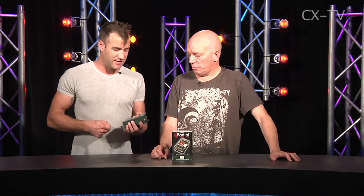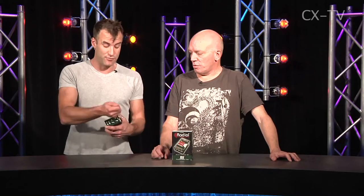A couple of things distinguish this. First up, internally, Jensen Transformer. It's passive, so there's no battery and there's no kabang when you unplug the mic lead. Any DI is going to go kabang when you unplug the input side of it. But if it's active and if it's phantomed, which this is not, this is not going to give you that problem.